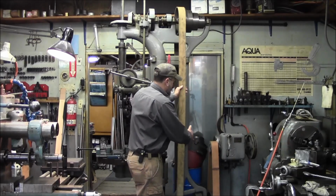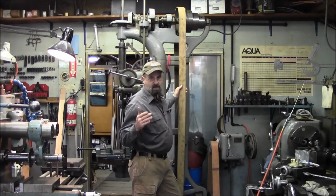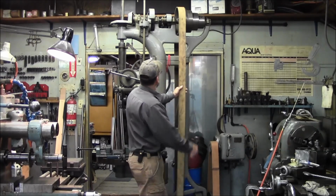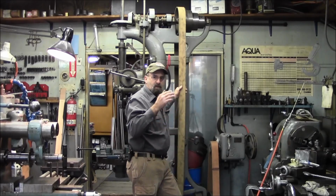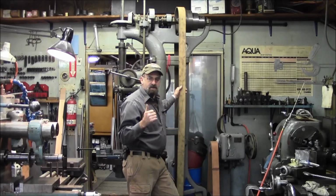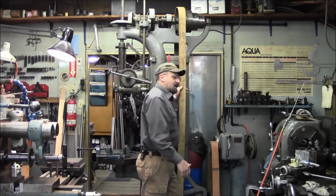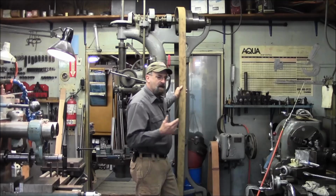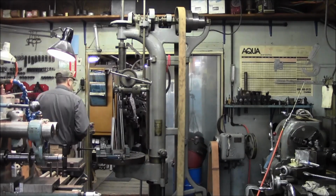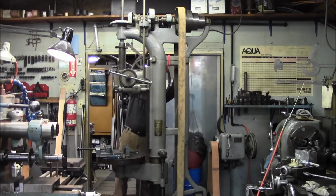So right there, there's 16 combinations that we can have. Alright, now there's one more gear that we can switch, and that's the back gear up at the top that breaks it through another change of gears, and it slows down the spindle even more. So then that would bring it to a 32 speed drill press. And we'll get this shifted over.